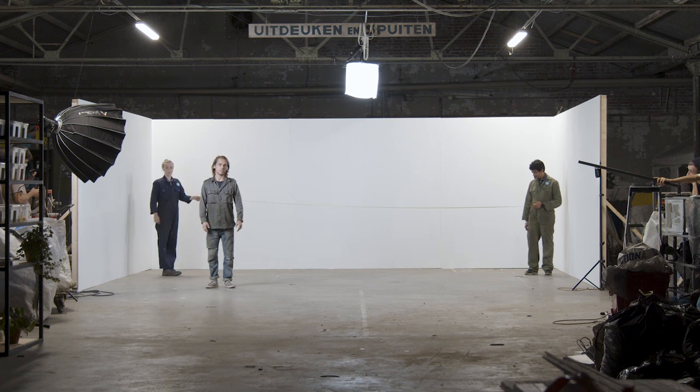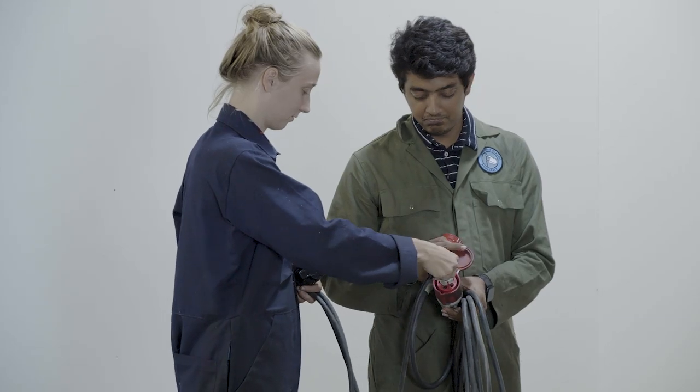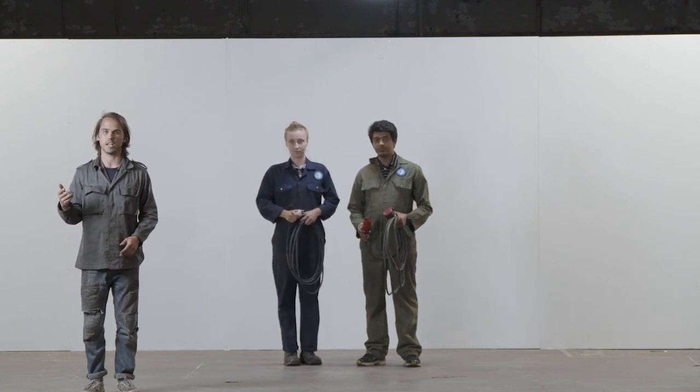The space we're using here is roughly 4 by 6 meters. And third, what kind of electricity do you need? The injector can run on single phase, but the shredder sometimes needs three phase, so be sure to check the specs of the motor that you plan to use.